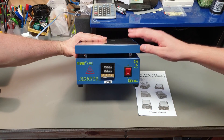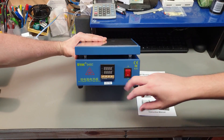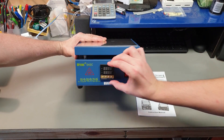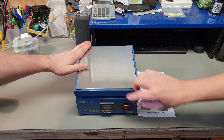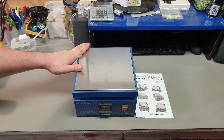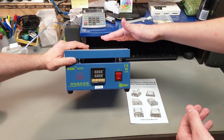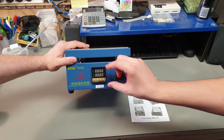It's a hot plate for reflow soldering. You can program it to go from about 50 degrees up to about 300 to 400 degrees. It uses one of these little control modules that's stuck in there. It's got an element in this block of aluminium and a thermocouple to track that temperature - quite simple. We haven't opened it yet. I have run it up before and found it's about 10% inaccurate - it reads low. So if it's actually 110 degrees, it reads 100 degrees. I'd be interested to see if there's a way to calibrate that on this little module.